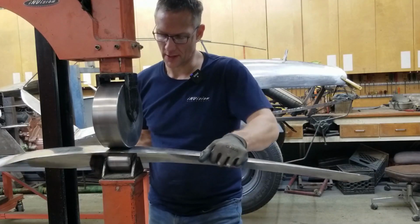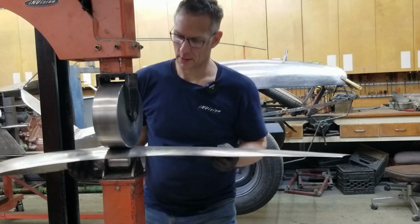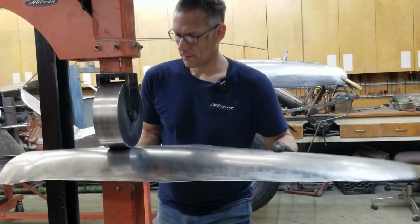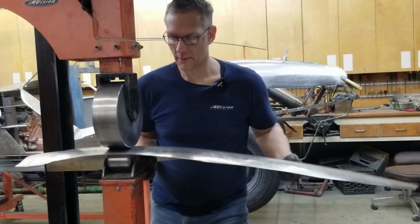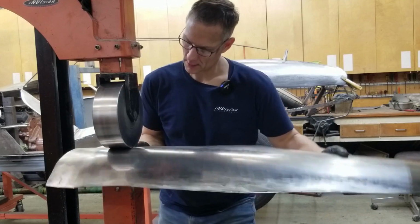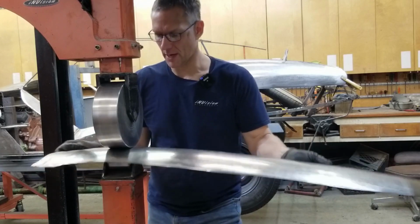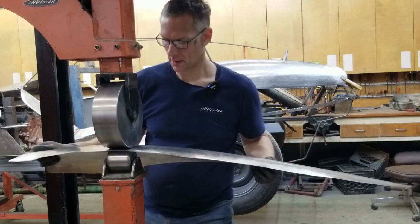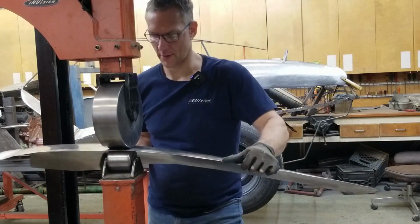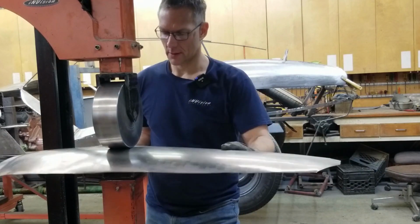If I tried to jam the panel in just horizontally, I'd never get it in. But by going on a bit of a diagonal, on a kitty corner, you can get the panel slid in between the anvils with this pressure on it. Again, I'm wheeling medium-high pressure, just to accelerate the growth. That way you can see the panel coming up faster than if I was going with lighter pressure. At the end of the day, you achieve the same result. It just takes more time.